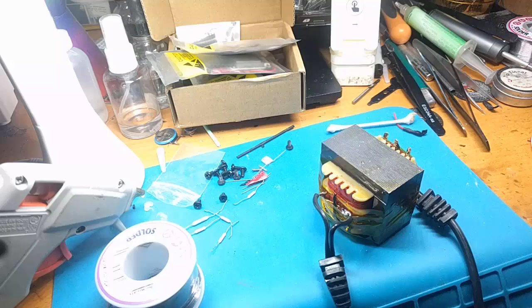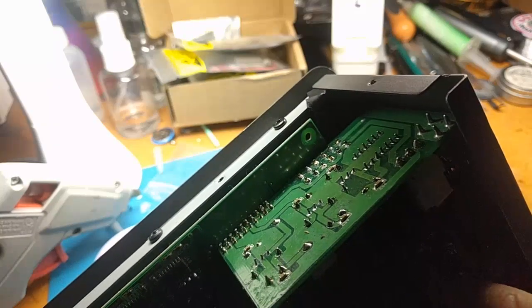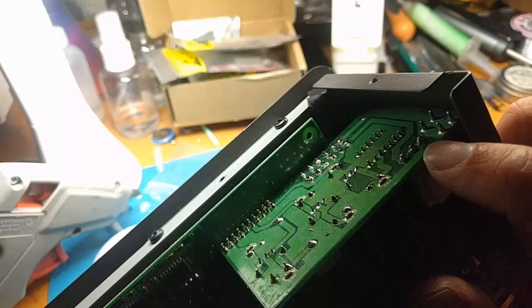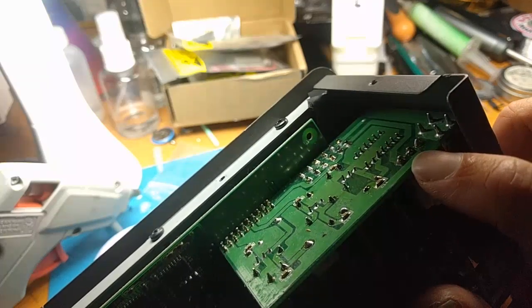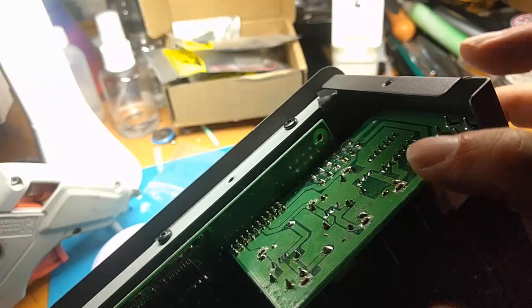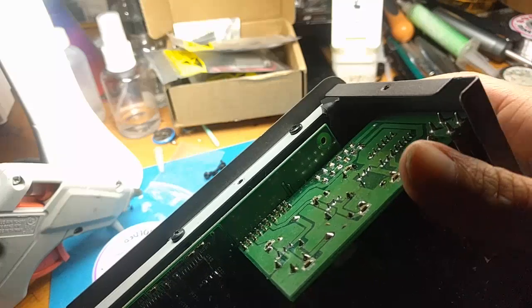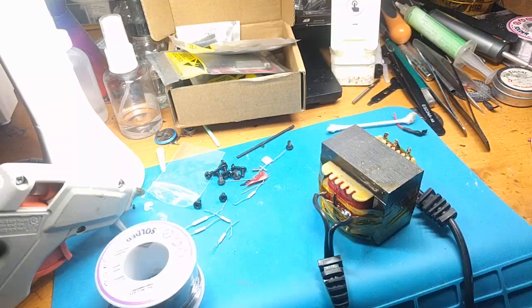One thing that's worth noting is that the power board in the Stanton mixer that this is for really wasn't designed well for these kinds of failures. This 3-pin plug right here, it's probably a JST plug. See those three pins on that connector? Super wide traces, folks. You see those super wide traces going straight down to the switch? So bad, because that means if there is a fault, it's not going to burn off the trace. And of course, ideally, there should be a fuse. Given that this is only outputting an amp total, there's no reason for those super wide traces. I mean, there's a negligible power loss in a thinner copper trace.